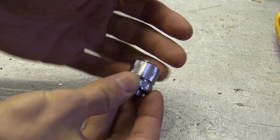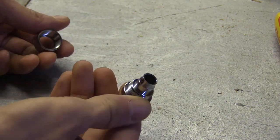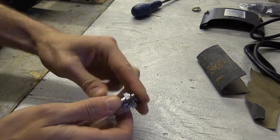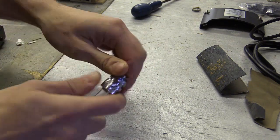I am planning on using a G¼ inch compression fitting, which I bought as a pack of 6 from a computer accessories supplier. That fitting happens to be the same thread as a ¼ inch BSP, and will secure the PVC cooling pipes to the spindle, its pump and the cooling radiator.